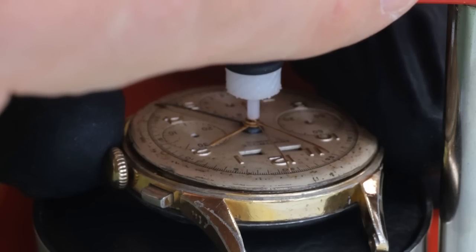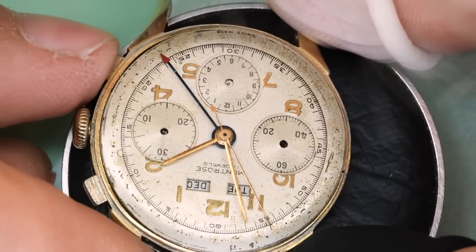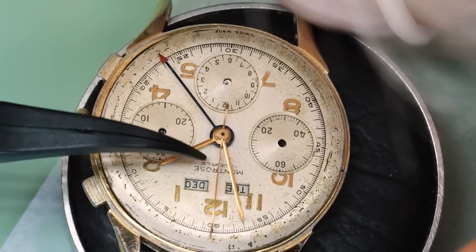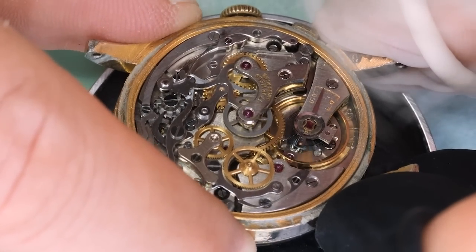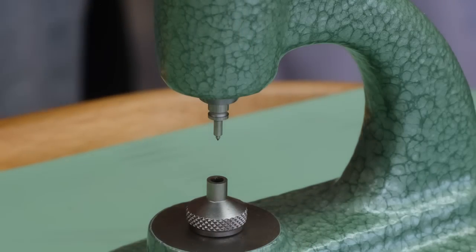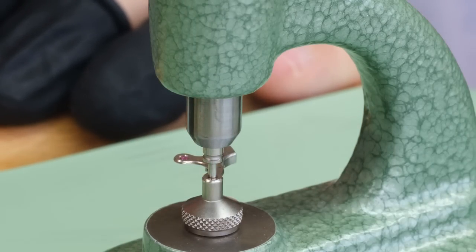The reset does not really work as it should, even though it did before. The issue when you don't have a movement holder with support on the jewel on the underside is that sometimes when you press on the chronograph seconds hand, you can push the jewel out of its position — and that's what happened here. We see that the hammer catches slightly on top of the chronograph wheel. To fix that we use a depthing tool that has a spring-loaded pusher in the center that fits into the jewel hole, allowing us to perfectly center the tool on the jewel, and then we can gently press the jewel in the direction we want — in this case, lower it a little bit.